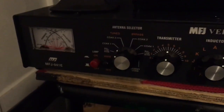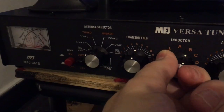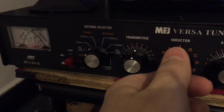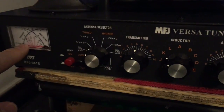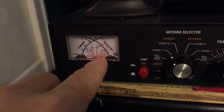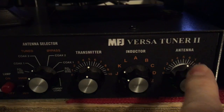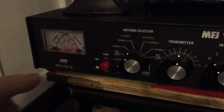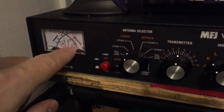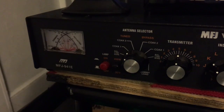So we're going to start with the inductor. I'm going to go over here and just play with the knobs — you can see it went way up, then we went to K and it came way down. See how low it is? That's with K on the inductor. So what you want to usually do is start with the antenna and the transmitter centered. Right now we're at about a 1.3 SWR, running most of our power out through the antenna, which is good.